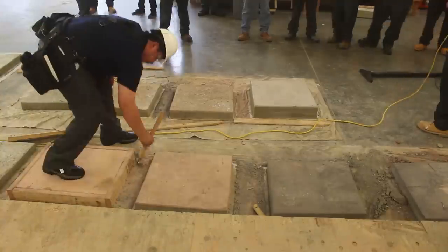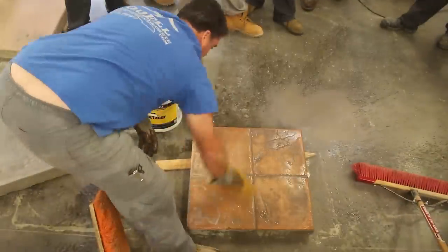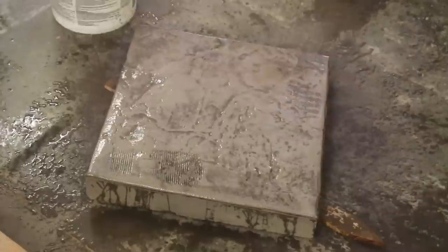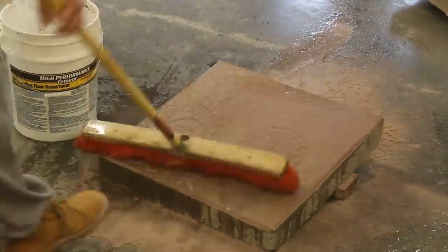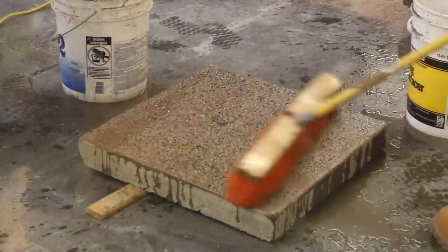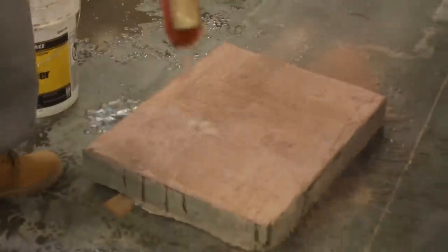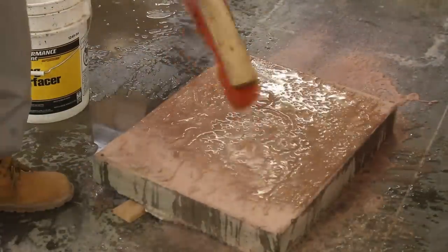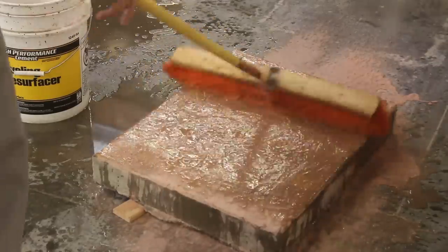Here's the day of the stripping, about three to four days later. Here's the one we broke up into four squares with two different color releases — Venetian pink and medium gray. Here's your stone gray, and here's your Venetian pink on top of sun baked clay. There's some of the artistic nature — this is with a color hardener on top of the natural gravel. We didn't seed it; we used the natural rock that was in the bag mix, threw color hardener, hit it with a top coat, rinsed it, and what's unusual is the color hardener was still there.